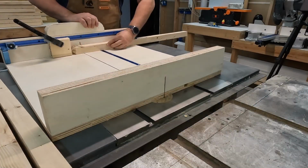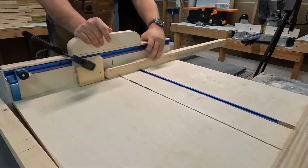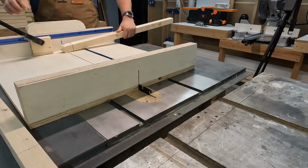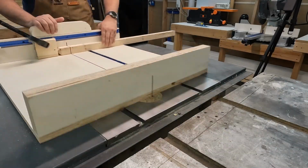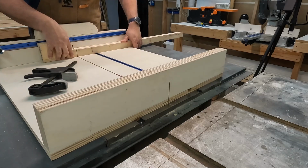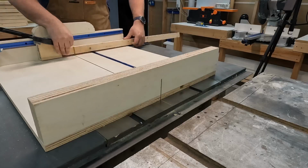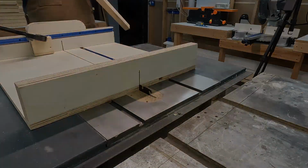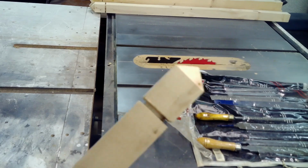I was going to use the stop block mechanism on my crosscut saw, but because I did this after creating the points, the stop was too skinny and it moved around the tip. So I had to switch to a thicker block so the piece wouldn't move. Next, it was just cutting all the little grooves and rotating the pieces. I had to move the stop block before making the second pass to achieve the 3/16 inch width I was looking for. Once I filed them out a bit, I was left with a nice little detail I was proud of.